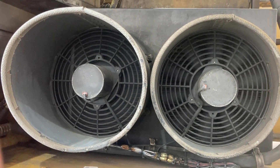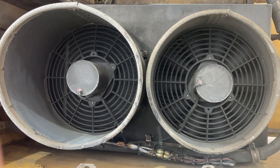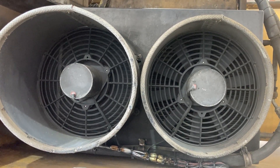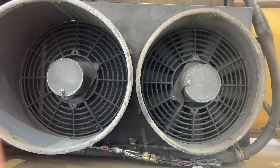The two condenser fans will turn on, but if they look like what's shown here on the right side in this video — the fan on the right is not operating. The fan on the left is blowing air past the fins of the right fan, making it look like it's spinning and working, but it's not working at all.